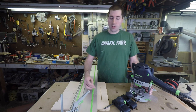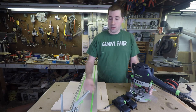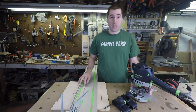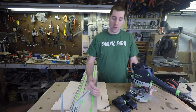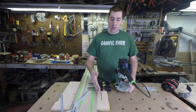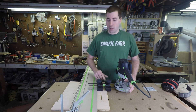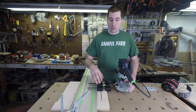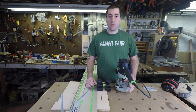You can see how quick and easy that was to make a nice stop dado here. If I was really concerned about where it stopped and started, I could add some limit stops onto the guide track to prevent the router from going too far in either direction and get the perfect length I wanted. The only problem with making dados with this method is getting the width of the dado exactly right — that's where this micro-adjust comes in really handy. You can put one of these on one side and use the micro-adjust to adjust your width to a very precise amount to get just the fit you're looking for.